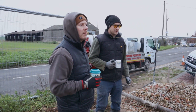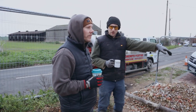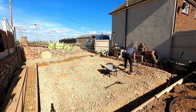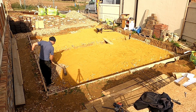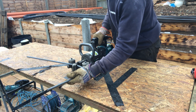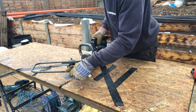Let's talk through the slab. How have you built the slab up? So I excavated it first and then laid it up with 150mm of hardcore — recycled hardcore — compacted it, and then blinded it off with a soft sand on top of that. Then I put all of the steelwork in. I bent all of the steel links by hand — every single one, and with teeth sometimes.